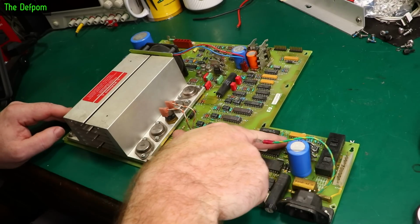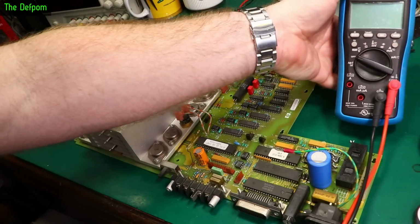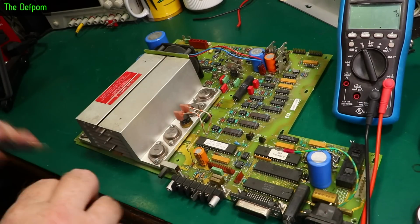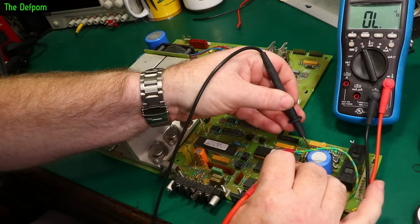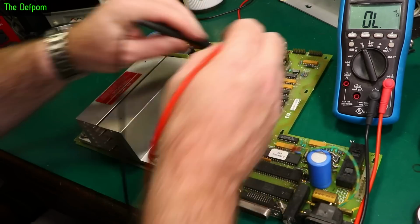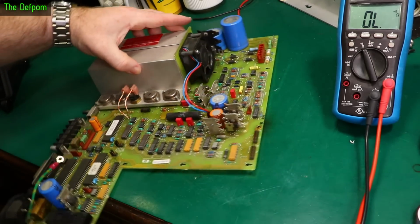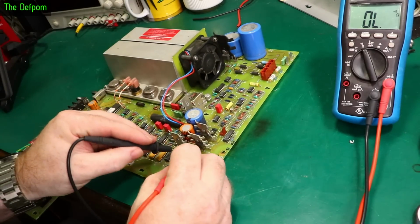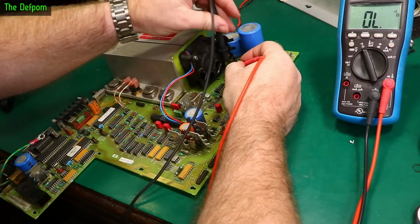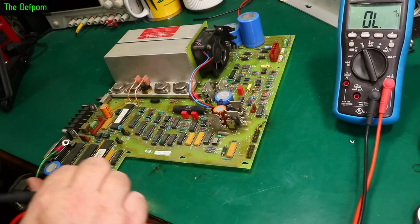We've got a Sprague tantalum cap over here, looks like tantalum. Another one over here. Then we'll get the cap tester out on the back and check the caps before we change them out. I just want to see what they're actually like. Let's check for any problems with these tantalums, in case it's shorted or something. That's fine. And that's fine. Any more? One over here. That's fine. Another one over here. That's fine. RT1. What the hell is RT1? That's looking interesting.